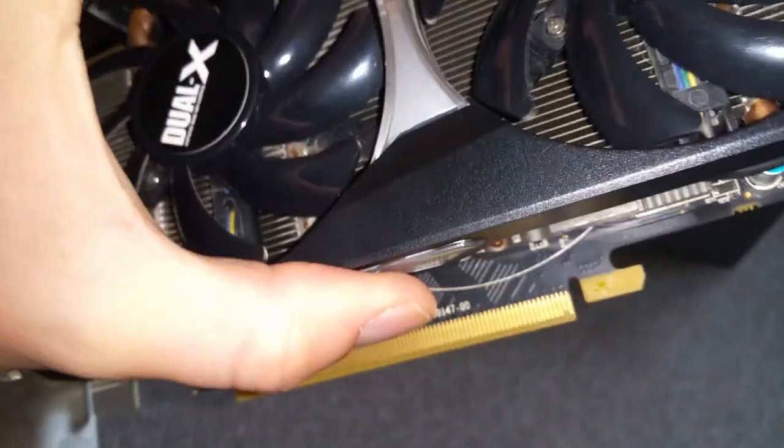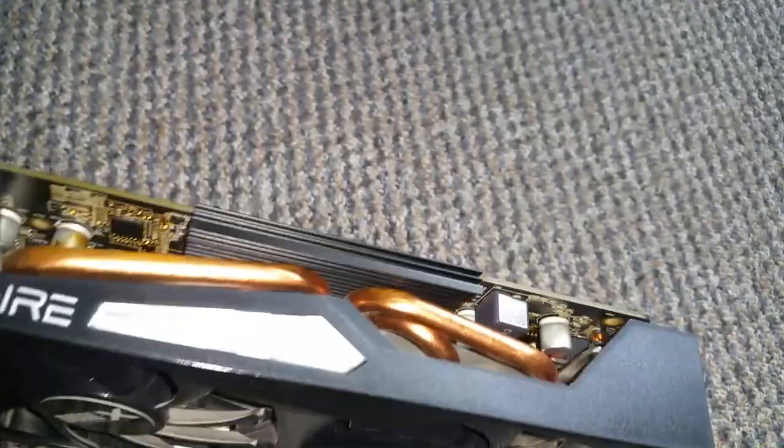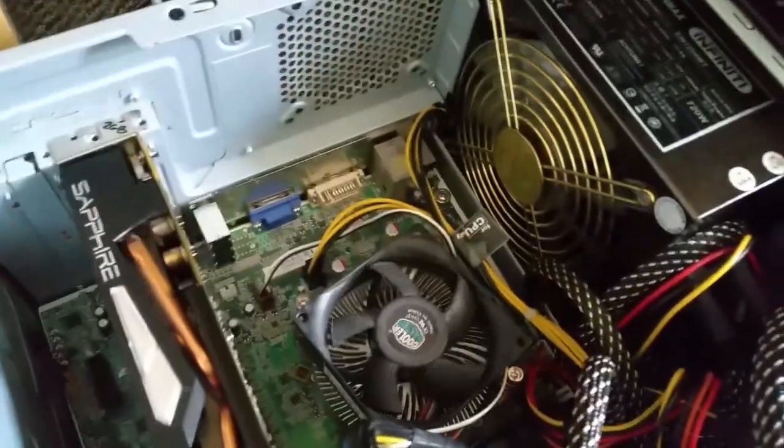First, I checked all the components I did before, and it looks fine. This card looks fine, someone wrote 2 gigs version on the top. It's quite a nice card, I like this design, it's very fine. What I actually did is plug in the 2 power cables here and my display cable again. Switch on my TV again to see, and now I will power on to see if we got a signal.